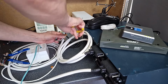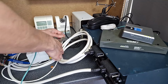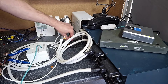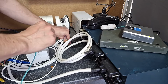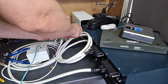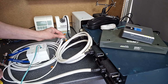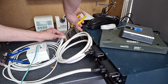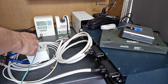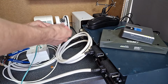Let's get the crimp tools. And we're going to crimp that one on. These are also external jelly crimps, which means they're full of a sticky, gooey substance to make them waterproof when they're out in the field. And we want the brown one to the blue one as well. Now, I'm hoping this just works, and in theory it should just work, but there's also a complete possibility that it doesn't. We will find out. Right, that is jelly crimped. Let's get rid of that.